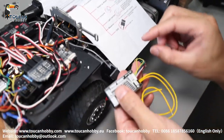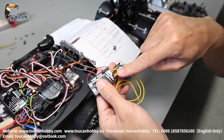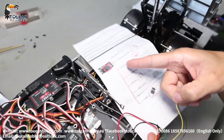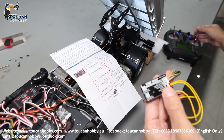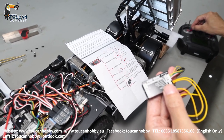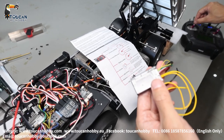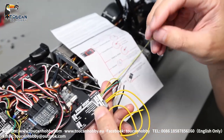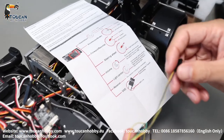So downside, the last one — black wire — and the top second one, yellow one, are connecting together. That's for accelerate and brake — for driving forward and backward. For example, this switch: driving forward and backward only starts after the sound starts. Stop — because also there is an engaged gear. Start driving, brake. So this last one — black and yellow — is for brake and driving. This one connects to the driving channel.